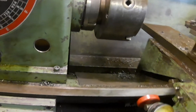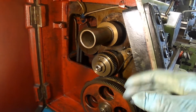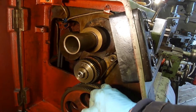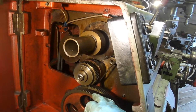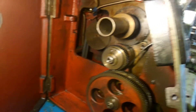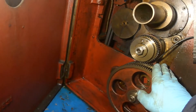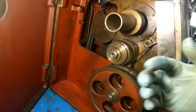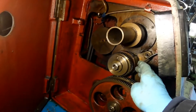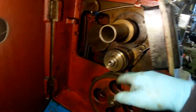I had to think about this. Those two gears - when it's 1.27 for English and 1.25 for metric, it's supposed to gear it down. To gear it down, the 127 would have to be on the input side and the 125 on the output, so it goes into the 127 and out of the 125, losing two teeth every rev and gearing it down. My idea is to take this off, put it the other way around, and it should gear it down instead of up. If the 125 is on the input and 127 on the output, it gears up - giving exactly the error we've got.